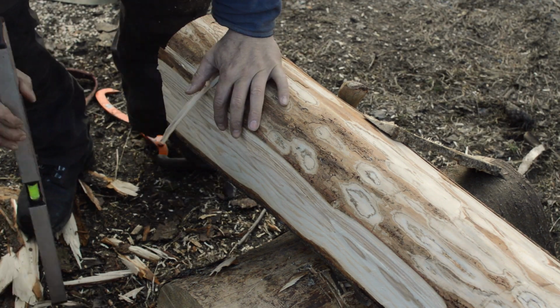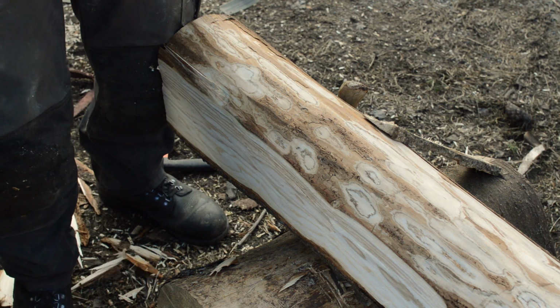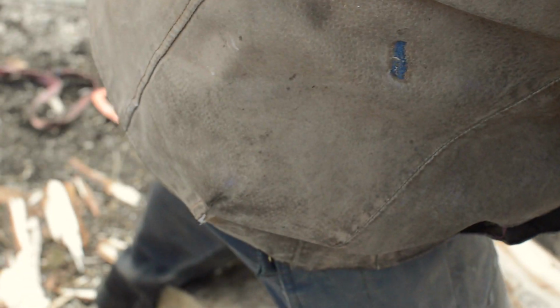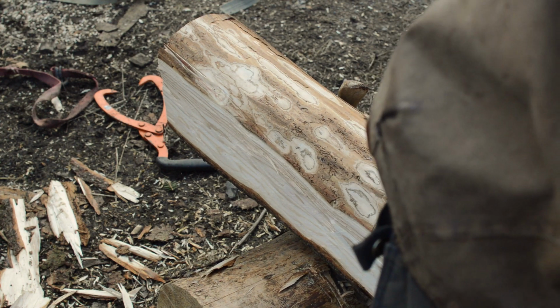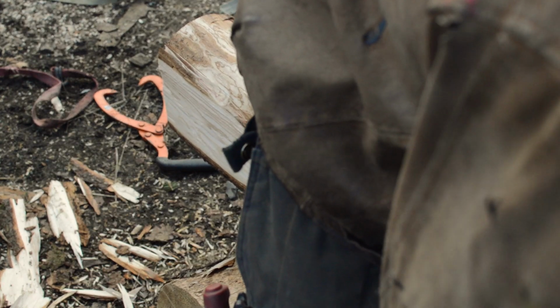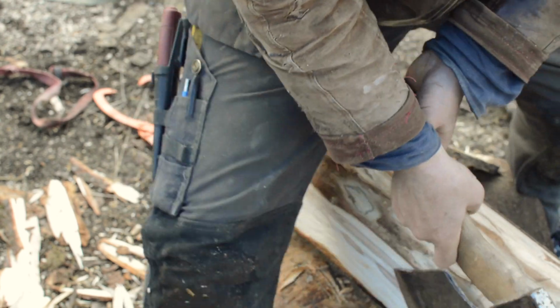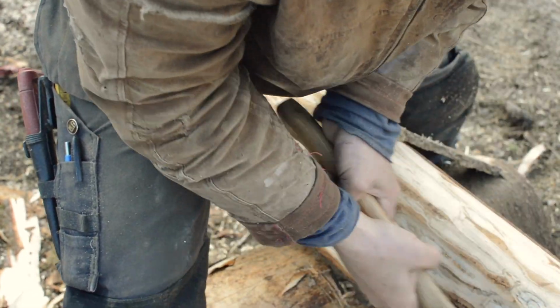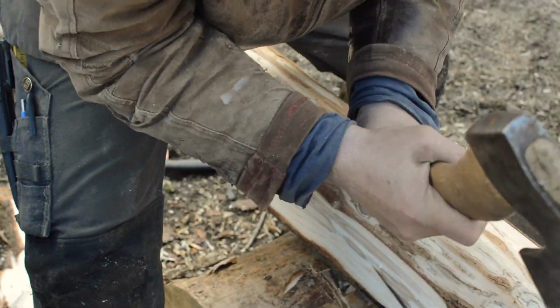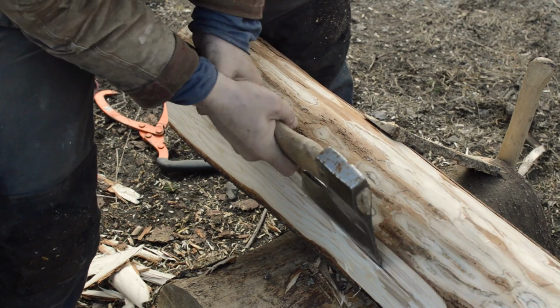So now I can use that just to check to see how much. Obviously, it should be thicker at the bottom, all the way down. Good. So it's about 6mm thicker at the bottom, which makes it easier to face to do the last kind of neat hewing. Because that goes a bit more across, it goes a bit more with the grain to face the last hewing.